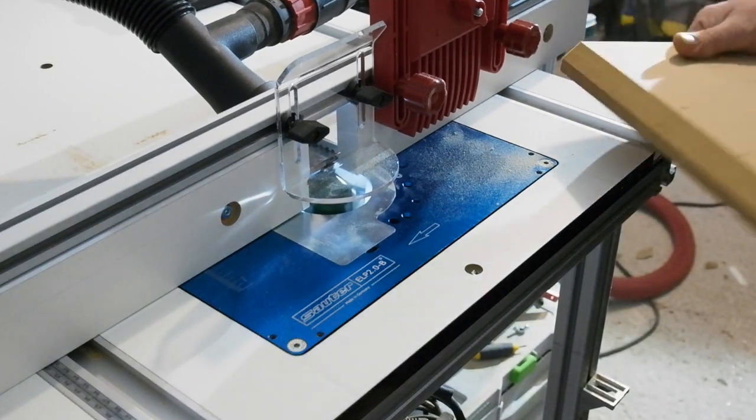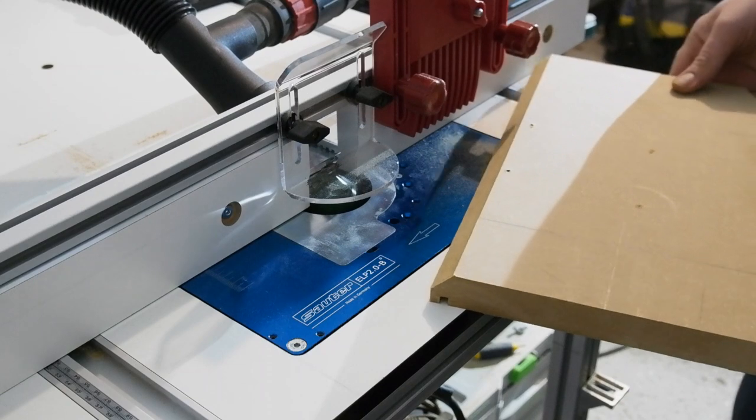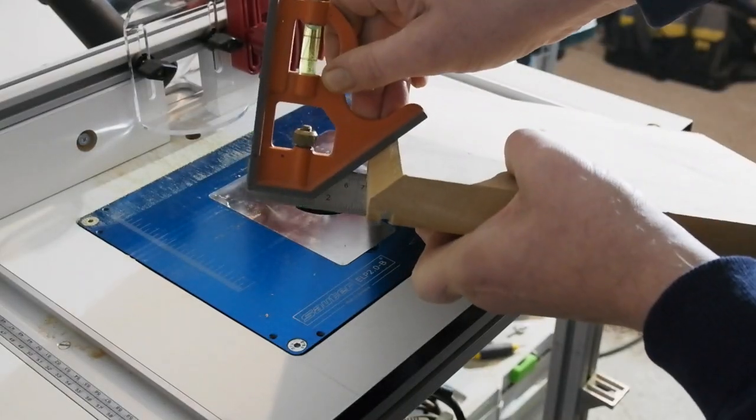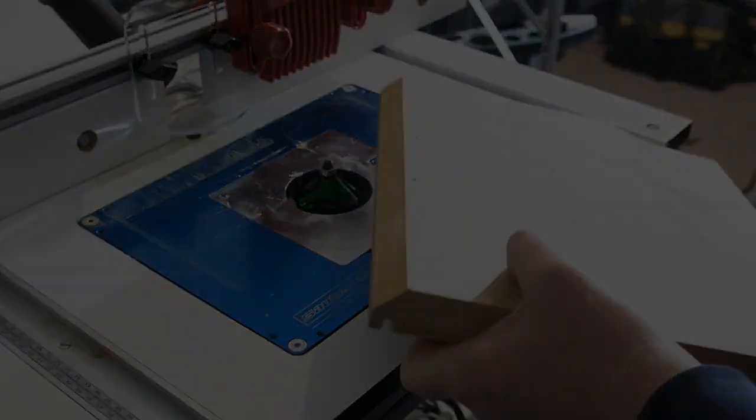Now of course, the router bit presumably being a perfect 45 degrees, I thought it worth checking anyway. I have checked with the centring pin that the plate and table were 90 degrees to the router spindle, but these being test cuts, I just like to check as I go — and all looks well.